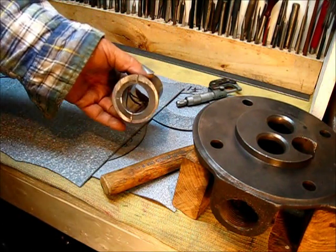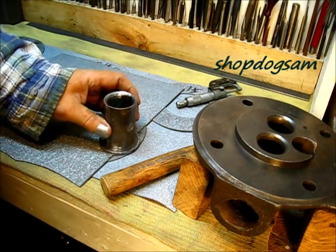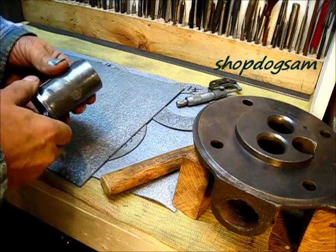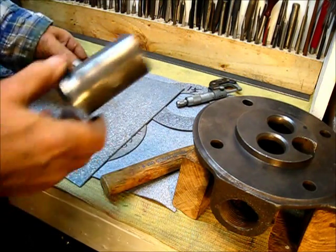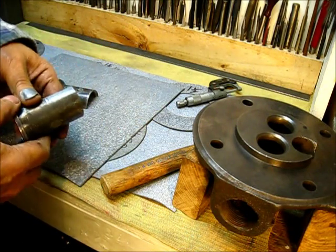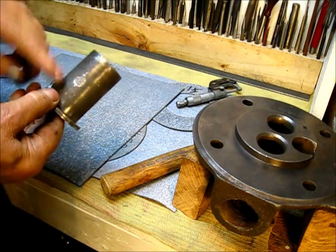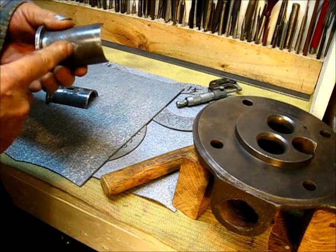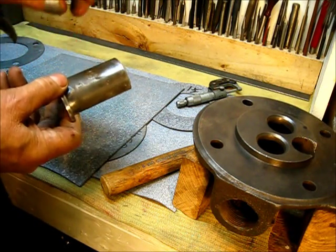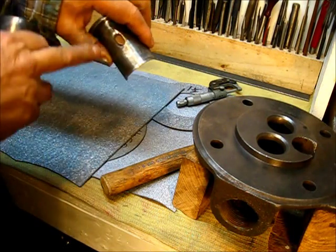A quick add-on: if you are putting two of these bottoms together in an engine to match up your bearing houses, you can actually use these bottom halves if you drill a hole in the center underneath the grease cup. You can use two bottoms — you don't have to have the top if you have two good halves.